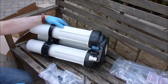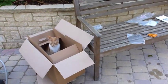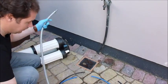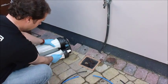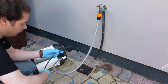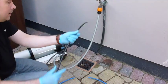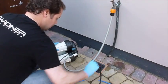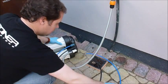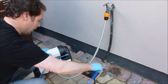Let's connect it up to a water supply. The inlet pushes into the white connection, and I've put a hose connector on the end. We then have our waste 3/8 inch tube which pushes in and needs to go down a suitable drain. And then we have our blue tube for the product, which push-fits in and would go into your filling tank.